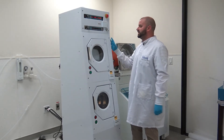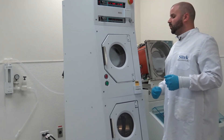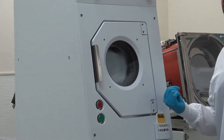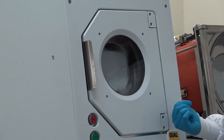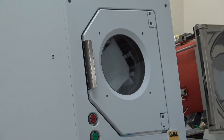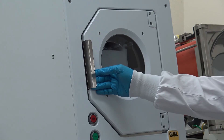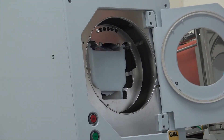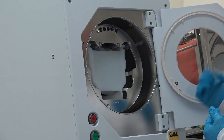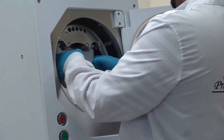15 seconds left. Once the clock strikes zero, it's still not safe to open the door — you could cause unwanted damage to your tool. What we need is when this clock strikes zero, once we get down to 75 RPMs, the RSP I mentioned earlier — the pneumatic piston in the back of the tool — will fire the rotor into the 12 o'clock position. But still, we need to wait for the door seal to release all air. There's the RSP — we're at 12 o'clock. And we're good to go. Door seal's released air. We have warm N2 purging in the bowl. No water droplets on the window, but we do have residual droplets of water in the bowl. This is good — you don't want your bowl to be bone dry.